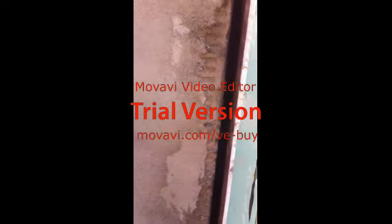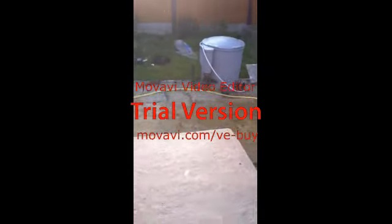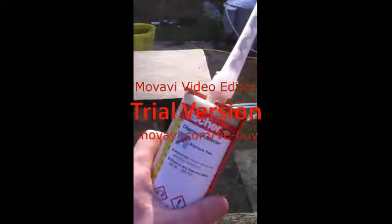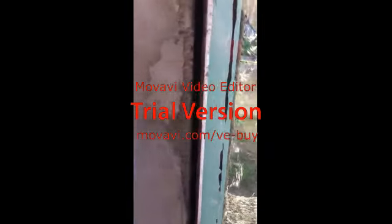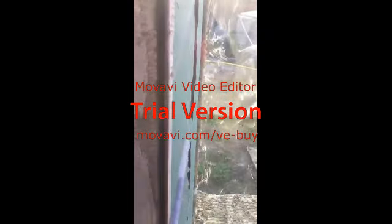All this gap, I will fill with a mortar or any other material. For today I'm going to use chemical mortar, and we'll squeeze it in here so that everything is fully filled, and later I'll do rendering up to the glass. You have to be very careful when you do rendering not to scratch it, and later everything will be painted with a special pond paint.